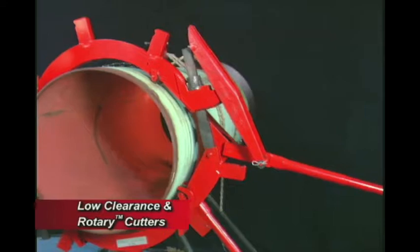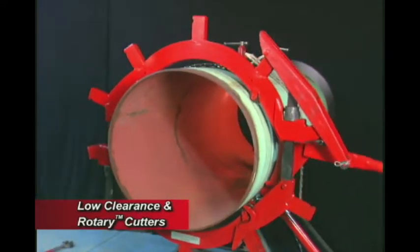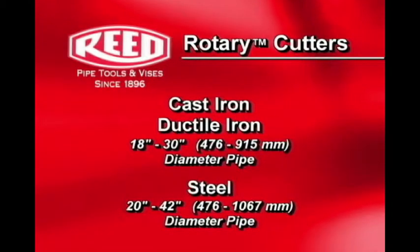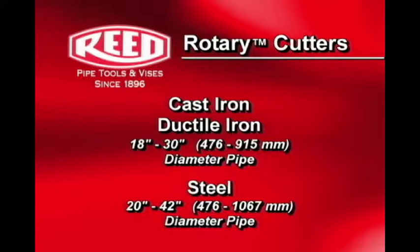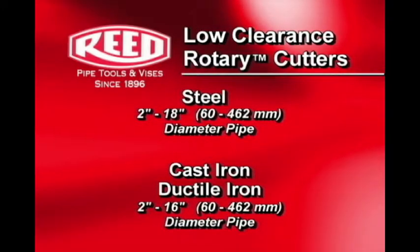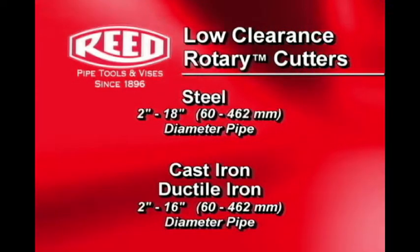To reduce downtime in the field, Reed rotary cutters have been designed for fast setup, operation, and disassembly. Rotary cutters can cut cast and ductile iron pipe ranging from 18-inch to 30-inch and 20 to 42-inch steel pipe. The low-clearance rotary cutter works on 2 to 18-inch steel pipe, as well as 2 to 16-inch cast and ductile iron pipe.